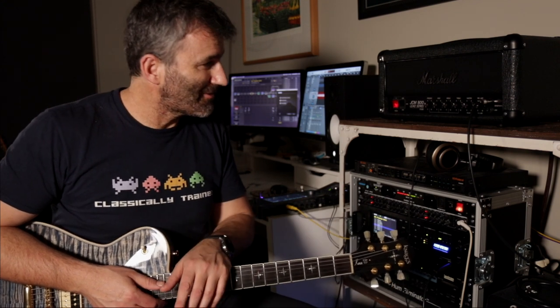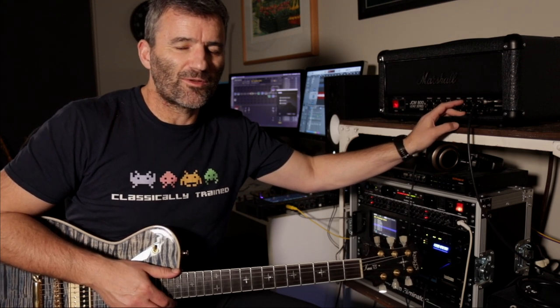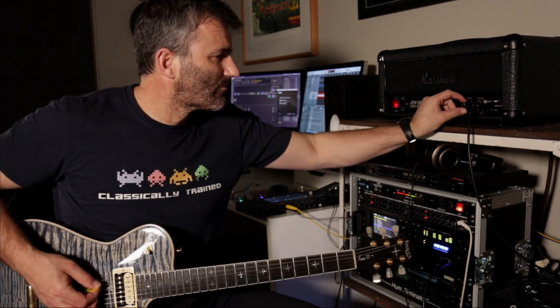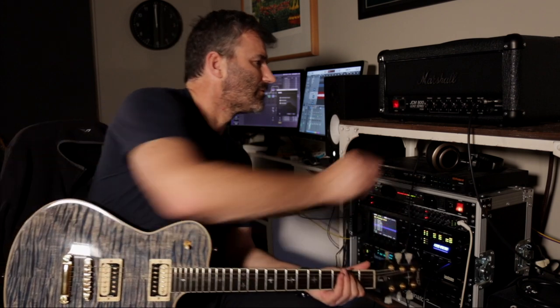And it's an interesting kind of mix, right? When you put this bypassed 10K cold clipper, 800 style setup with a kind of Zener clipping, you get a pretty aggressive, bitey sound, right? So let's have a listen to that. So I've just set it in the first of the clipping modes. I've done this the way I've done a bunch of my other mods. If you check out some earlier videos, you'll see that I've implemented this Zener clipping the same way. I've got it settled on a configuration that I like and I use. This is a 20 volt Zener setting, and I'll just bring the master volume up a little bit because we do lose a little bit of volume once the Zener clamping comes on. The master's at midday now.